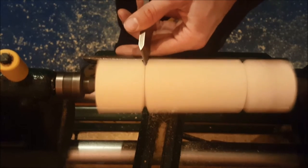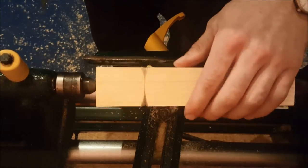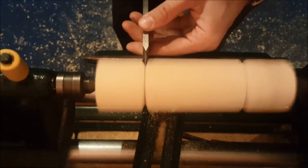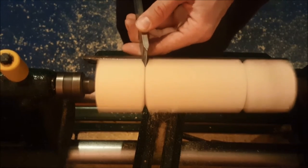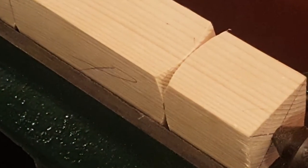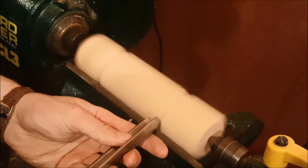My V is starting to form here. I'm starting off at an angle and I'm working my way in. Don't be afraid if it starts to chip off at the end — you're going to tidy this up later with your skew chisel. Keep it going in, small little cuts at a time, and there we have that round cylinder going the whole way around — or the circle, should I say.